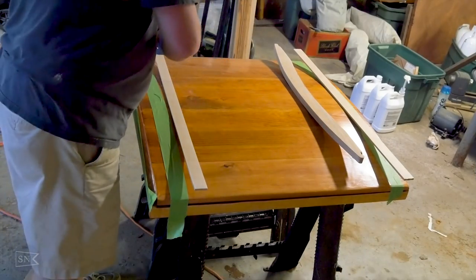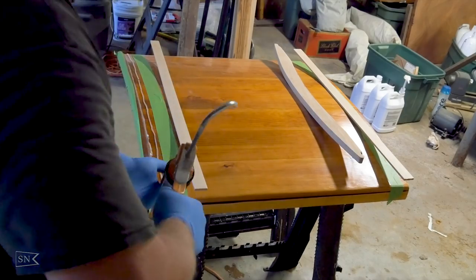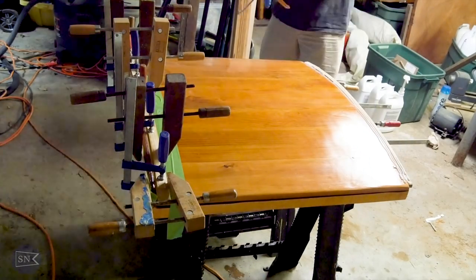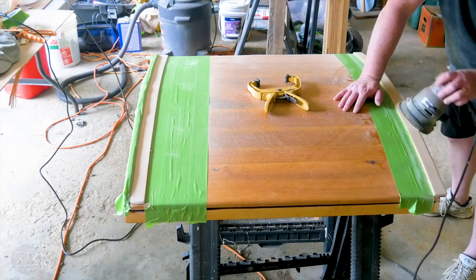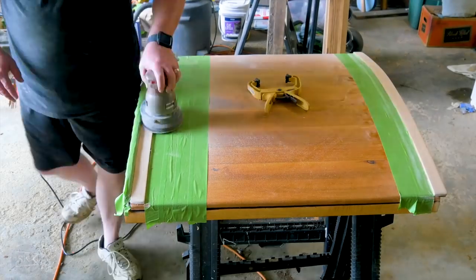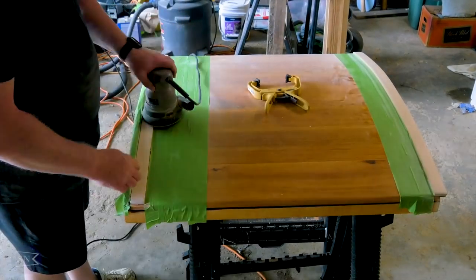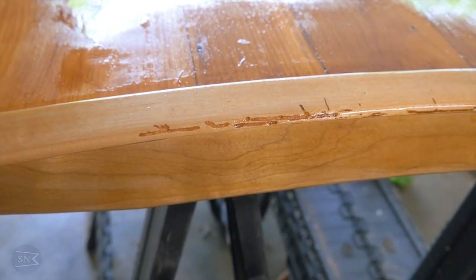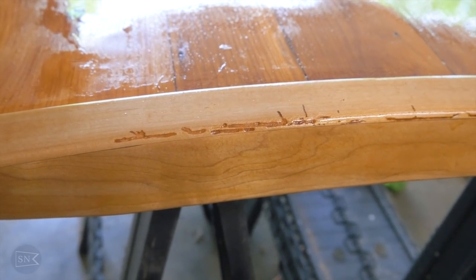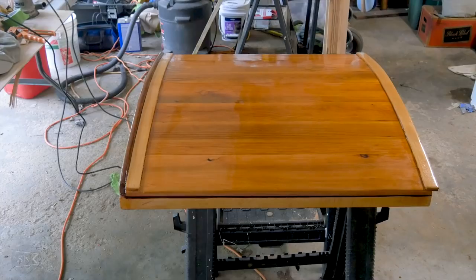I wanted to seal the seams at the front and the back with thin strips of wood held there by Thixo. But just so you know, not everything turns out perfect. As I was sanding the wood in prep for the final coats, the back strip of wood revealed a little void. I figured I'd just sand it out a little more and even it out, but turns out the void was some sort of wormhole in the wood, and sanding it out more to get rid of it only made it open up more. I decided to just stop before it got any worse and write this off as character of the wood — my boat has a lot of character by the way. But all in all it looks much better and I think it'll handle the weather and UV exposure a lot better.